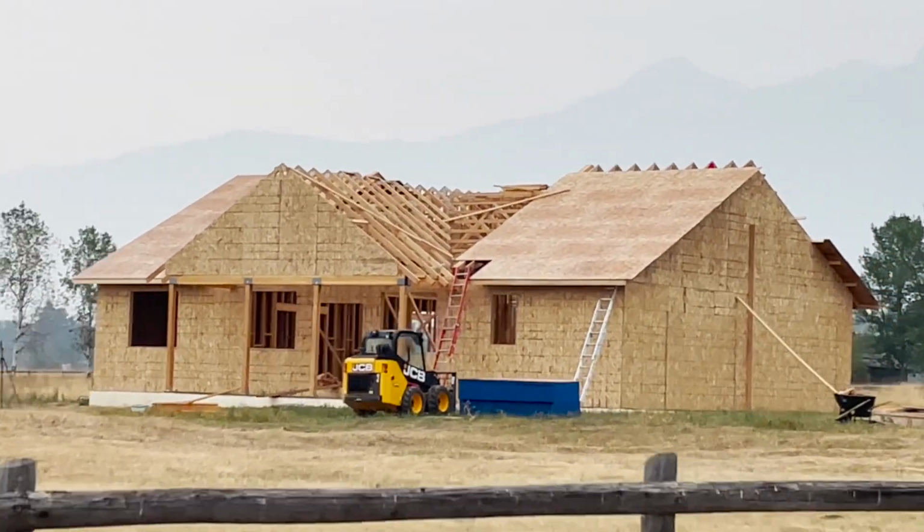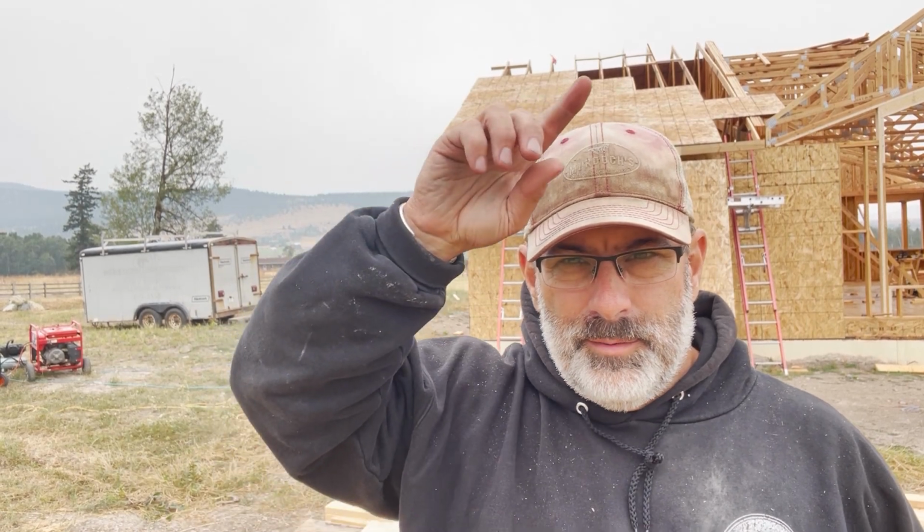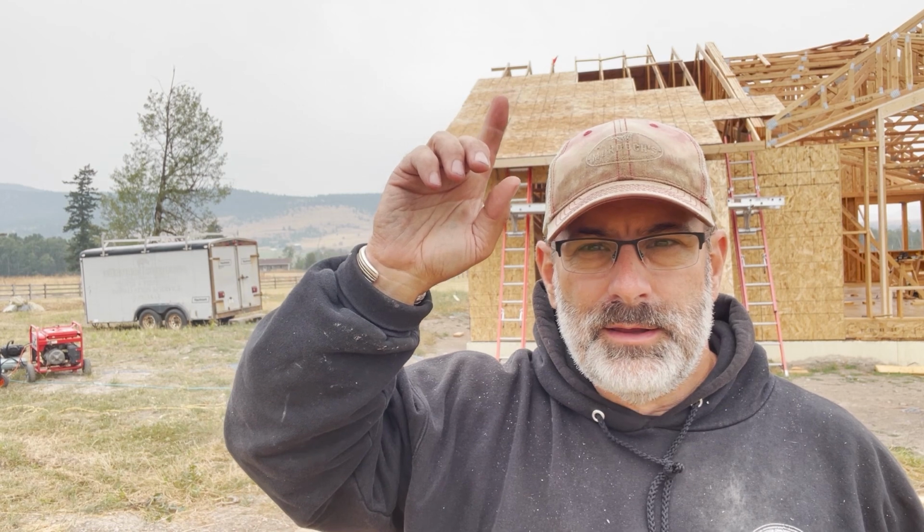One thing, I don't know if you can see it or not, but we're working up this side of the roof with the sheeting. We're training the trusses to go straight in line. These were the ones that were all kind of waved out when we did the original setup, and so we're using the 8 sheet.